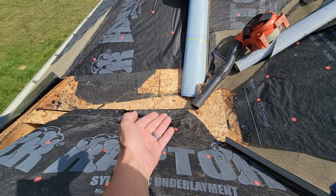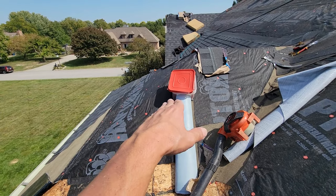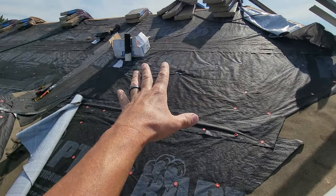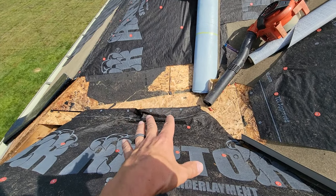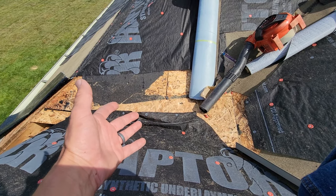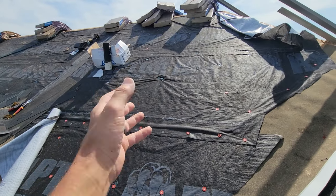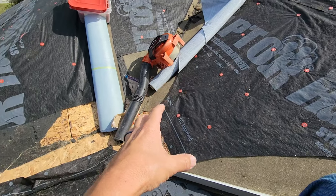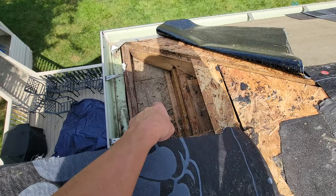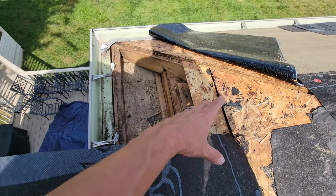Even if you have a little bit of a slope — say a 3/12 — manufacturers say if you have a 3/12 slope and use ice and water, they'll honor it. The biggest thing is you get a section where water sheds, comes down, gets into a low slope area. In my region we get freeze and thaw and snow, ice. It's warm in the attic, it melts, it runs down — the precipitation's in liquid form, runs down, gets into here. When you get over a soffit area like this right here, under that piece of wood is outside air under the soffit — it gets cold and freezes up that area.